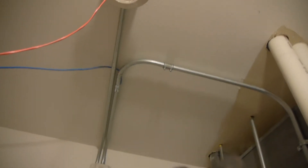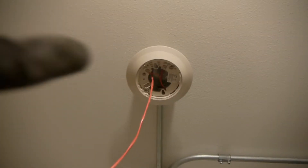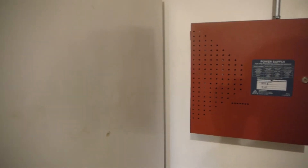You can see there's a little bit of extra wire so when we insulate there'll be some slack. It goes back into the mechanical room back there, into the smoke detector head. I left some extra so we can staple it and insulate everything. This is up in the attic — I'm not going to show you what's down there because that's a surprise for system test one. The cable comes down through a hole in this back box. Here's the smoke detector up on the ceiling — it comes in through the attic and into the back box. Here we have a remote power supply connected to the garage power supply, and there's conduit going up to something else.